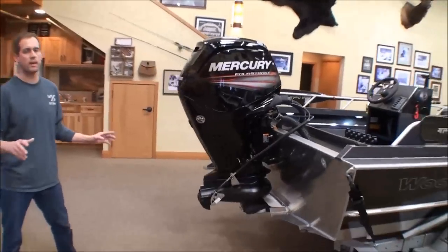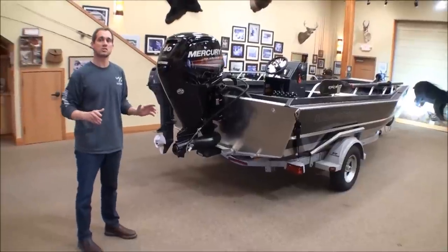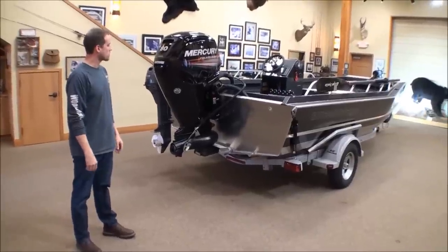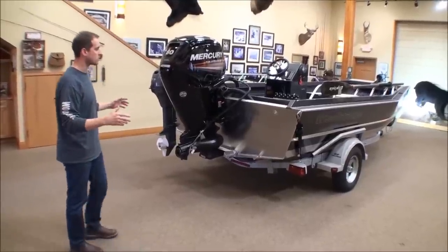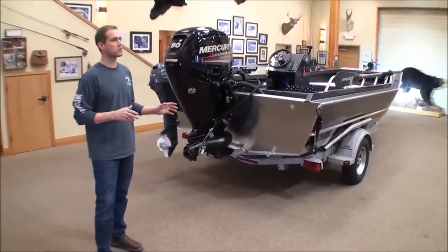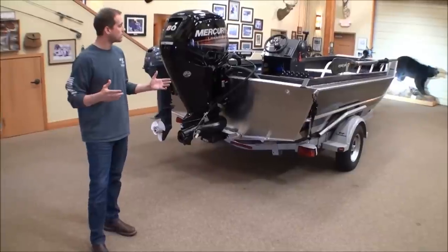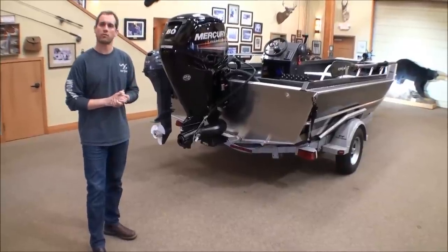This is a 17 foot 10 inch model, based off our 20 foot Alaskan XL, which is an awesome tracking boat. It doesn't just side drift well — it pulls plugs well and floats super level in the water. It has a 76 inch bottom with an 89.5 inch beam. The 20 XL was so popular we thought, why not build a smaller version of the XL to get into some of those smaller rivers?